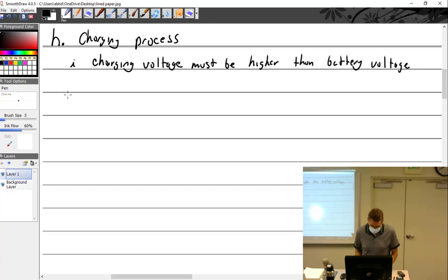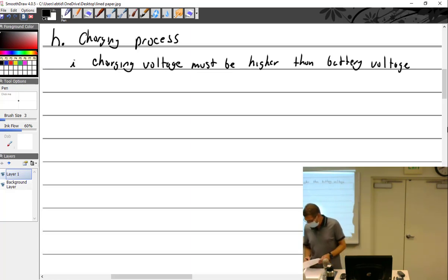Lead sulfate. What happens to a battery that sits dead? Sulfate. It's sulfate. And that sulfate's good or bad? Bad. Okay, as batteries recharge, electrolyte moves from a water-like state to a more acidic, sulfuric acid state. You can have a problem where you overcharge a battery.